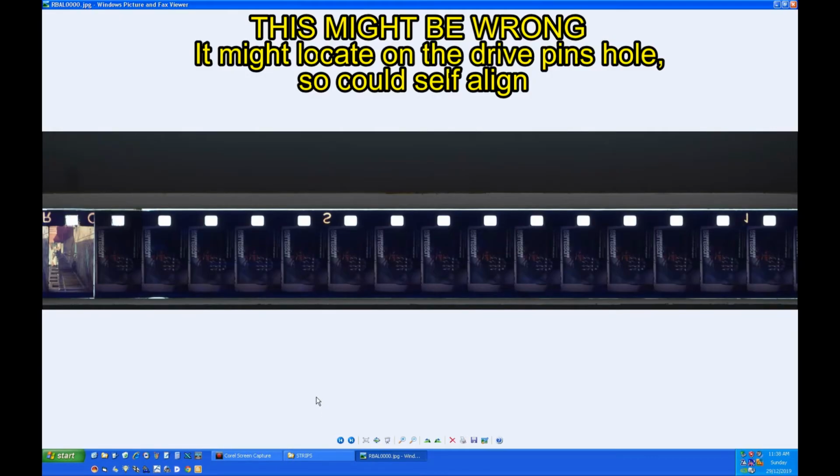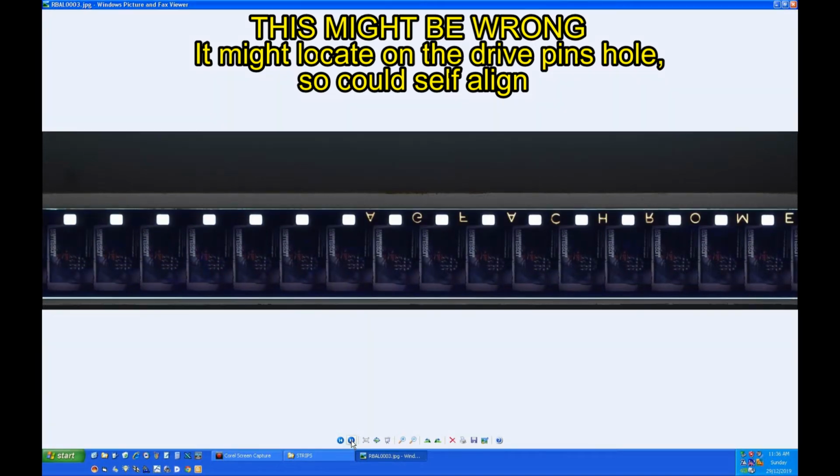Mechanically, I think it does a rectangular box select and copy over each frame, but the box select has fixed XY coordinates, and that means if the location of a strip isn't similar each time, the frames will wobble and look like shake. And that's dependent on the clearance in the guide and how much the film can move sideways, and on the position of the edge that separates frames. As an example, keep your eye on the clearance and the frame position on this sped up video.